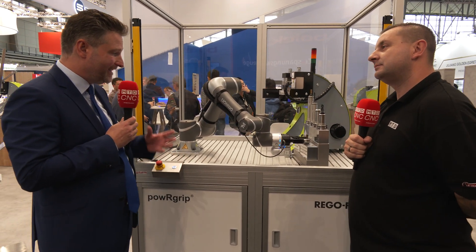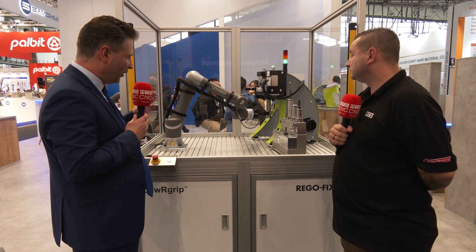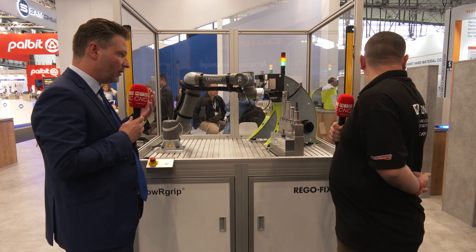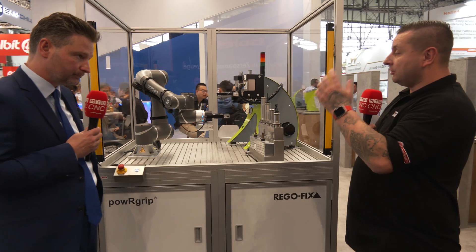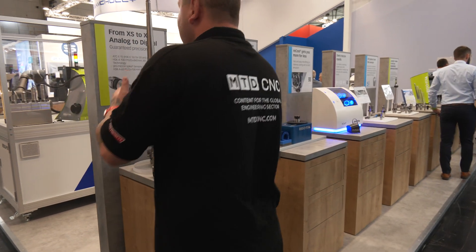Since Power Grip is a very easy two-button system, it's also very easy to automate — meaning to let it work with an industrial or a collaborative robot. What we're showing here is an automated Power Grip unit that can be operated with any kind of robot: making the tool change, picking up the collet, placing it inside the tool holder, the tool holder inside the machine, and clamping it. Fully automated and a very cost-efficient solution, because easy to operate means easy to automate, and easy means low cost. With the skill gap and skill shortage, it also helps keep your machine shop running.